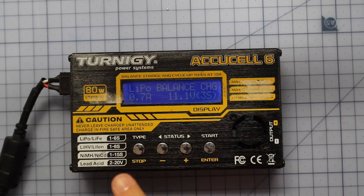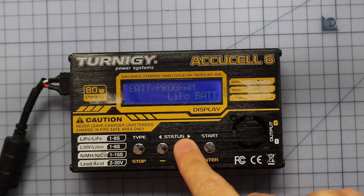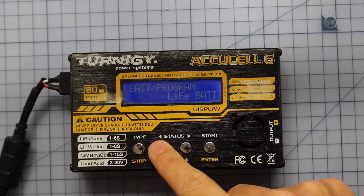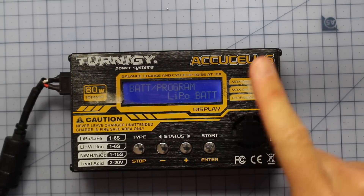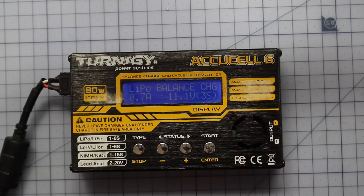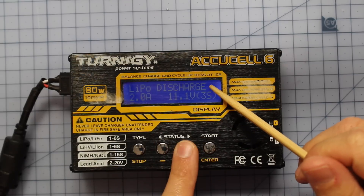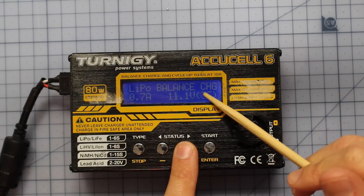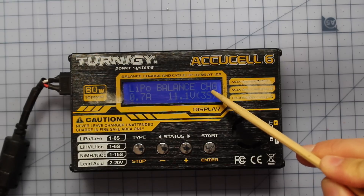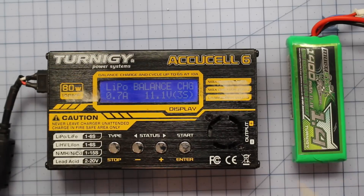In the charger menu there are a couple of different battery options - LiPo batteries, a high voltage LiPo, and more. What we're talking about today is LiPo, so in your battery charger you want to be charging on the LiPo function. You then get a few options: balance charge, normal charge, fast charge, storage, or discharge. Pretty much the only charging I do is a balance charge, and it's good practice to always balance charge your LiPos to make sure all the cells are at the correct voltage.